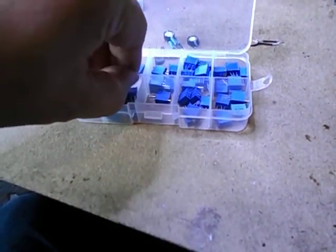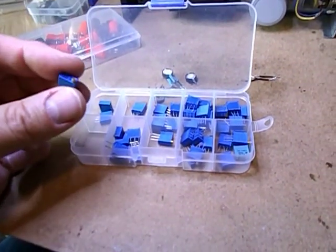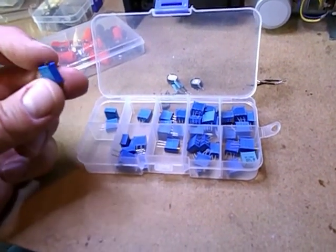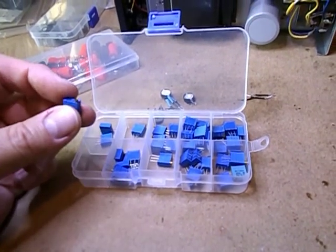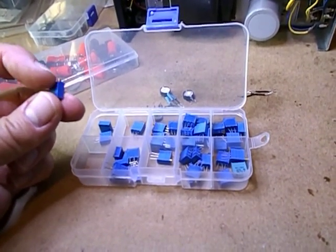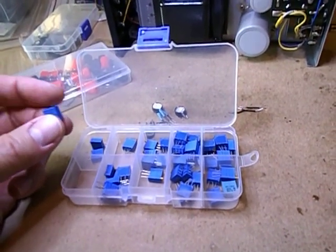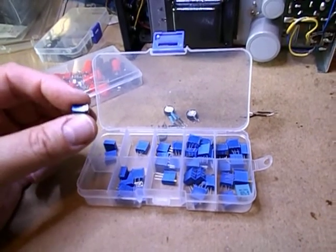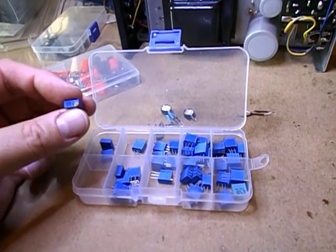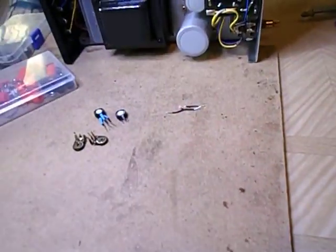Here's what I found: the 500-ohm bias pot — sometimes a 1k in Sansuis — cannot handle the current. If the adjustment is off, these will fail fairly quickly, in less than a year, or even months if you're listening to it fairly often. I've also found issues where the internal screw mechanism, which is very small and fragile, will break and jam inside. These are good for low-current set-and-forget applications, but if you're tweaking them frequently they don't seem to stand up to it. Anyway, thanks for watching and listening.